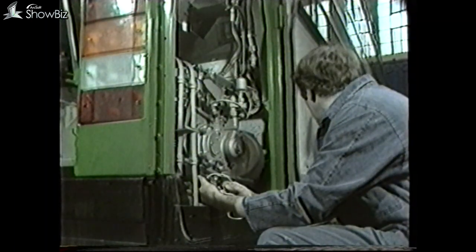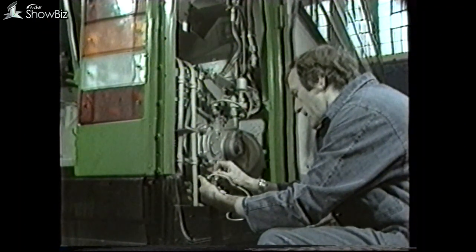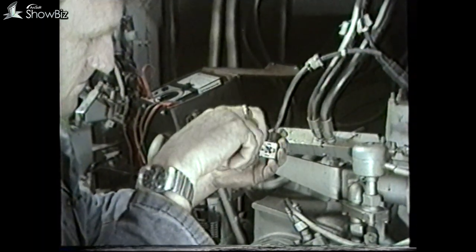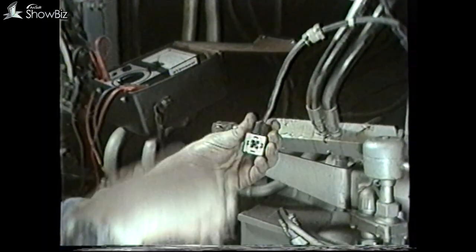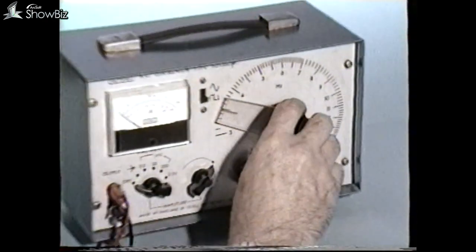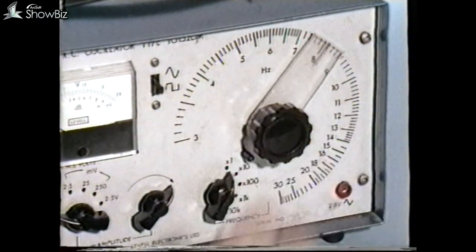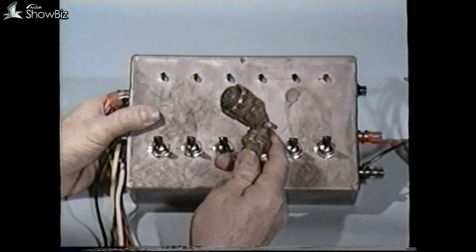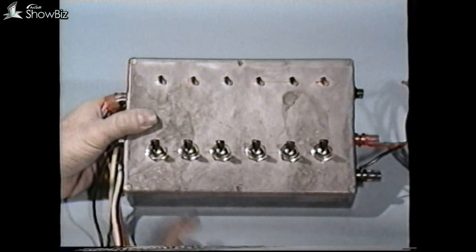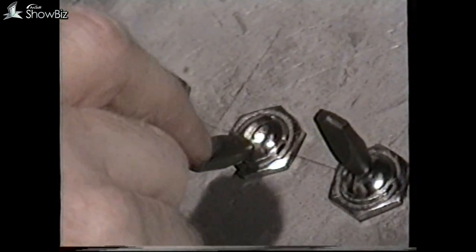This program has been designed so you can fault diagnose the transmission system with basic test equipment — namely a test lamp, pressure gauge, and test meter. Inevitably there will be a percentage of faults that will require in-depth expertise and specialized test equipment. Here for example is an oscillator which can feed a variable speed signal to the panel replacing the function of the transducer. A gear switch box which plugs into the EH block provides a convenient means whereby any gear or gears can be selected, enabling a quick check of the basic operation of any gear or for brake band adjustment.